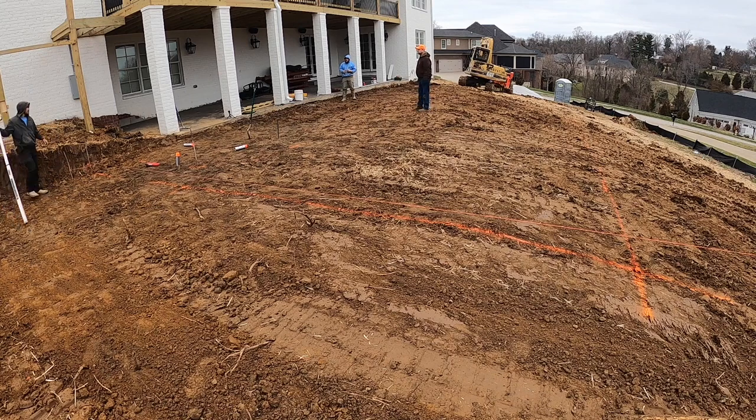2.5 inch coping, travertine. How big is the track? 1.5 inches? Yeah, 1.5 inches. So 2.5 plus 1.5 is 4 inches. So that's our 0. 4. Okay. So set the transit at 1 foot, and I'll load the transit all the way until it's on there.